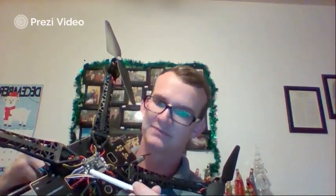Make sure that your ESC, the capacitor, is going to connect to the front of our flight controller. The front is the opposite end of where the plug-in is for the USB, the micro SD card, as well as your micro USB port. Capacitor is going to go on this far side, which is where we're going to end up connecting the battery. So from there, once you've found that this is the front, installed your ESC in that manner,